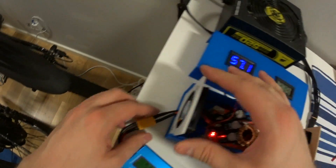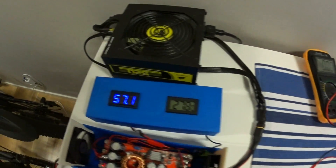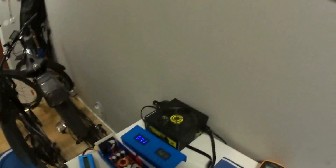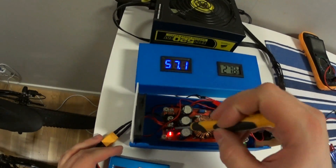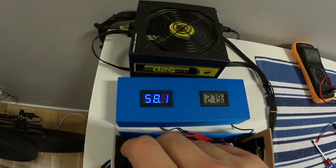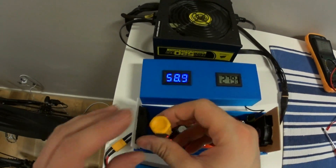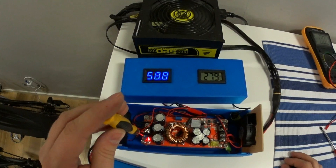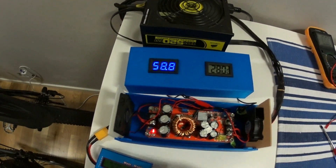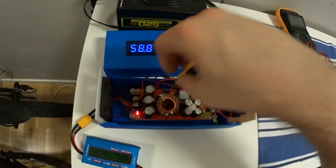The unit is on, the fans are on, and we get 57.1 volts. You can customize this from 12 volts up to 83 volts, so you can use it for all different e-bike batteries — 32 volts, 42 volts, 48 volts, 52 volts, or up to 83 volts. It's totally customizable; you can use a screwdriver to lower the voltage to your needs. My battery is 52 volts nominal or 58.8 volts maximum — it's a 14S — but this is only for testing purposes. I recommend lowering the voltage; if you have the same battery, try 57 volts or even less to save your cell life substantially.